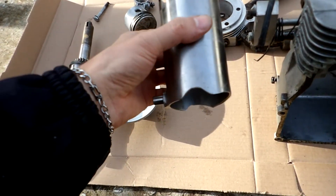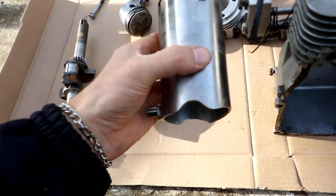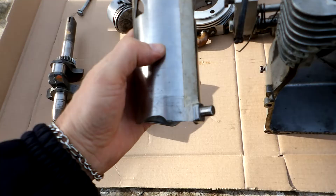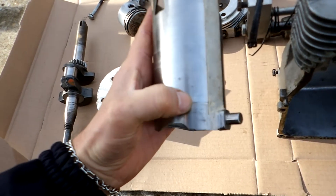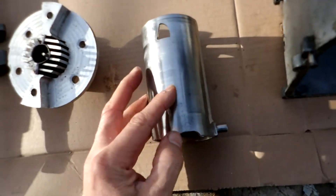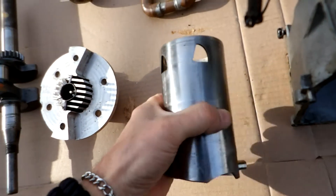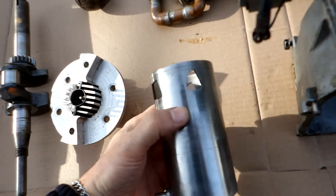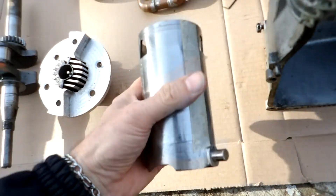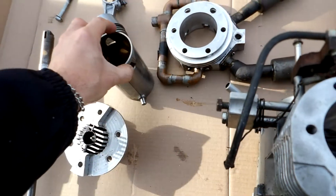There are cut-outs at the bottom to clear the crankshaft and connecting rod counter-weights. The drive pin is integral with the sleeve. You can see our machining problems getting it quite circular, and if you look close in the light you can see an ellipse — that shows the shape that the sleeve actually moves in. It's definitely an ellipse. Inside I had parabola-shaped scratches — that's the shape the piston traces inside the sleeve, because they both move, giving you funky parabola-shaped marks.